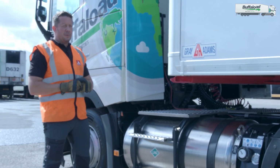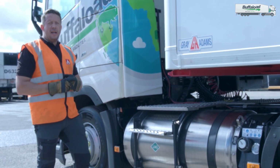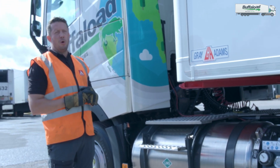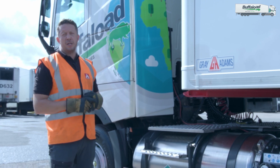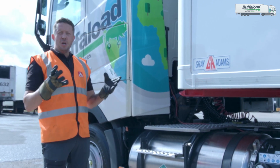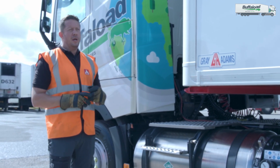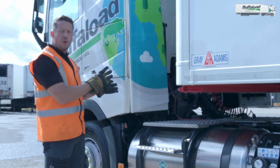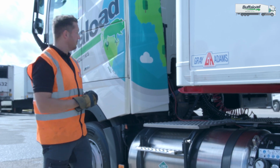Okay, what I'm going to do is mount the catwalk. It's worth mentioning, when you're coupling in this manner, i.e. this is not a split couple, there is less room on the catwalk. However, there is room for you to function and connect your Susie lines. It is not for everybody. Therefore, if you wish to split couple to give yourself more space on the catwalk, you can. However, it's worth mentioning, it is nice and tight, so be mindful of that when you're going in.